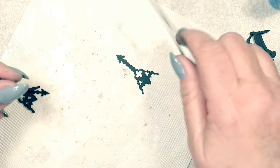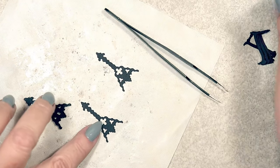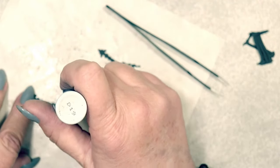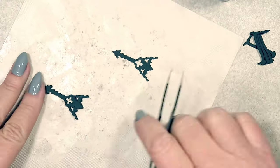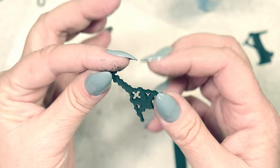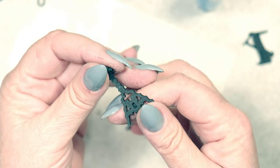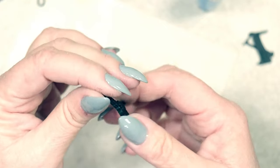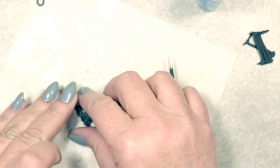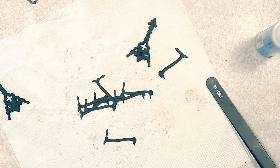The final two layers are overlays that will conceal the central construction slot and give it a finished appearance from the front, while leaving that handy little slot in the rear, so that we can build three-dimensional pieces from these. Repeat this process so that you have two of these andirons pieces, each consisting of eight layers and two overlays.